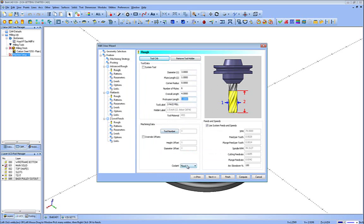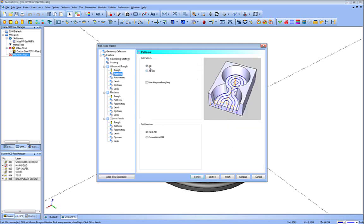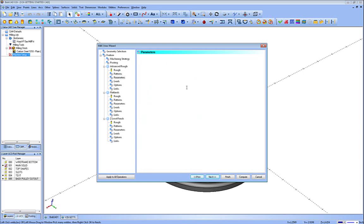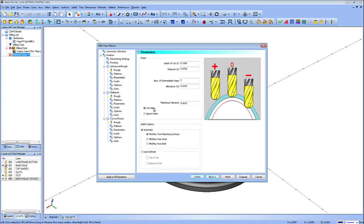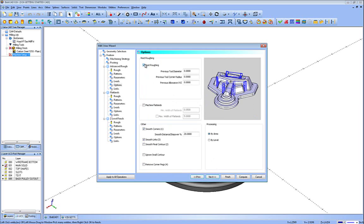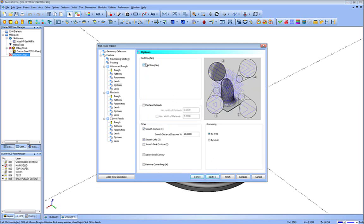You have your tool number, offsets, coolant, speeds and feeds. If the material library checkbox is checked, it looks at the material library; if unchecked, you can type in your speeds and feeds manually. We're going to do a zig climb mill. You can also do high-speed adaptive roughing if needed. Step down we're going to do at 150 a cut, step over at 875. We're using a three-inch cutter. We're going to turn on intermediate steps to two for staircase removal, and we'll leave ten thousandths all over the part. We'll leave cut holes on and use overall depths at first. For entry methods, we'll use the plunge option.